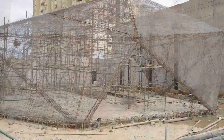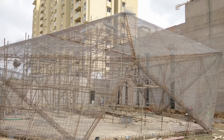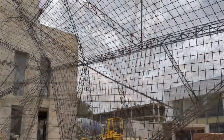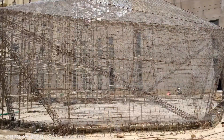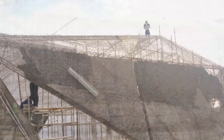We also used three layers of chicken mesh — a 26 by half hexagonal chicken mesh — put over it and tied from both sides on each and every cross-section. This was followed by casting using 1:3 mortar, followed by finishing plaster and painting.